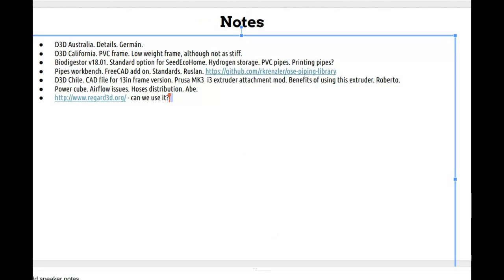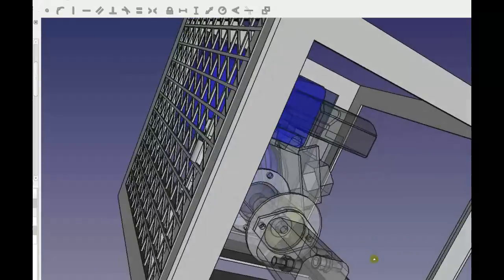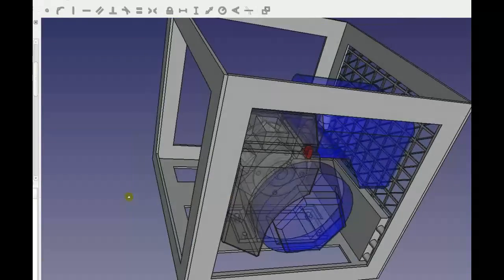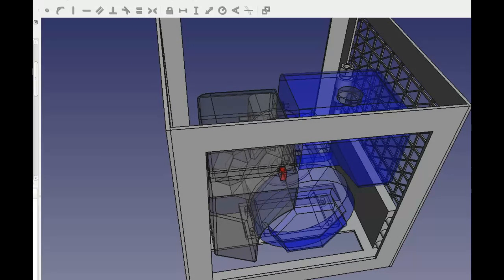And how do you control the quality of the dimension of the printed part? The plastic which the printer uses is a soft material, and I think the parts which are printed are not really precise, or am I wrong? Well, the nozzle is very fine, so you get, people claim, like 300 micron accuracy, a fraction of a millimeter. It's still quite precise because nozzles are pretty small, like 100 microns or 200 microns. So you just let out a very small piece of filament, but that's part of the problem because it's so tiny, it takes so long to print. That's why we want to go to bigger print heads like 1.2 millimeter, which is not going to be as precise, but for large objects, that doesn't matter.